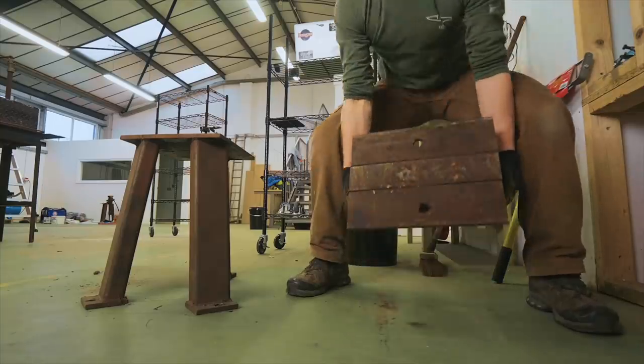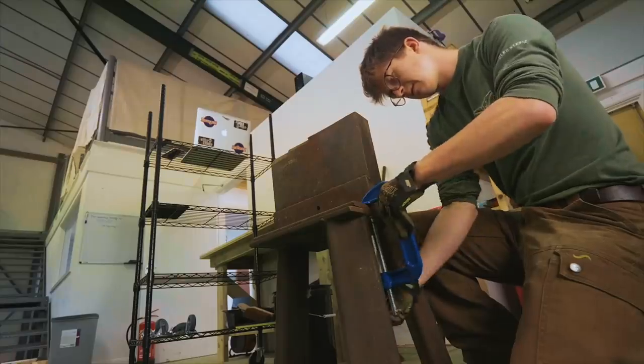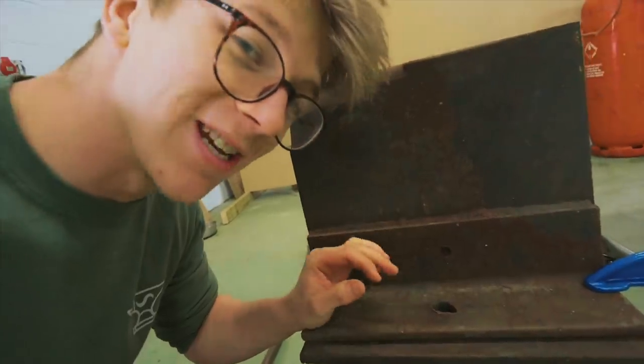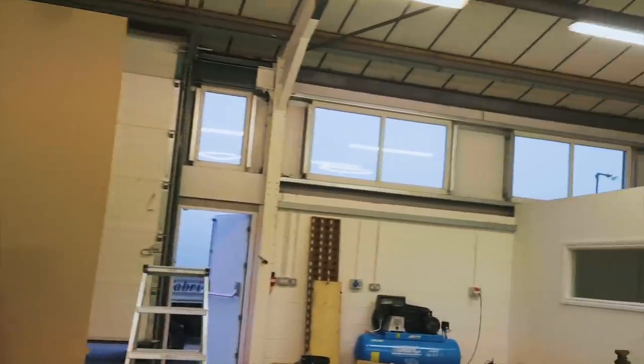You might be asking yourself: what is this that you keep referring to as an anvil? This is a die anvil — it's a block of mild steel with three shapes on it: a flat face, a large fuller, and a small fuller. This is something my blacksmithing teacher Bren Brazil came up with, with the intent of simplifying forging by having a really simple anvil so techniques could be explained with as little confusion as possible.